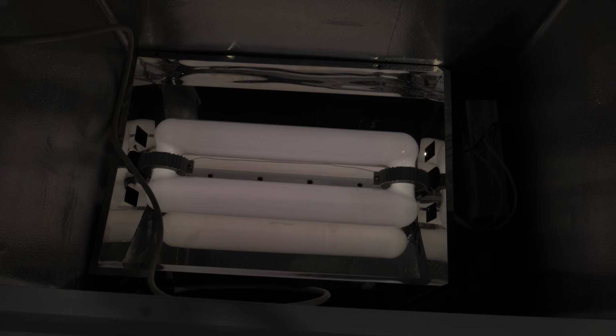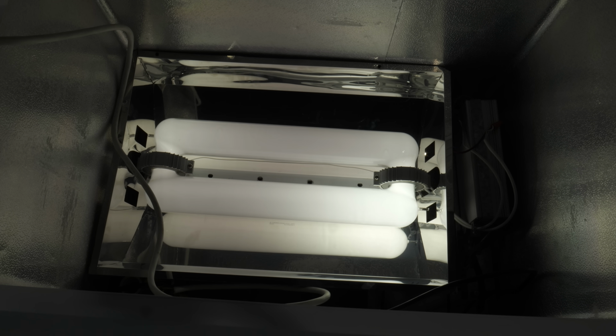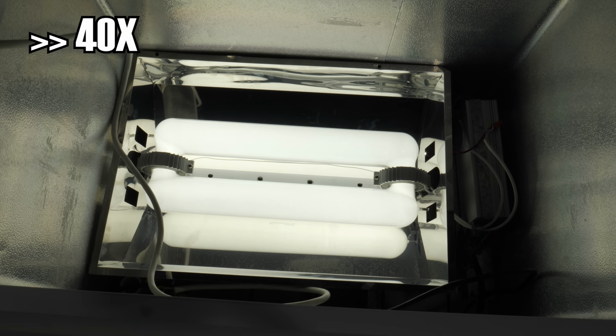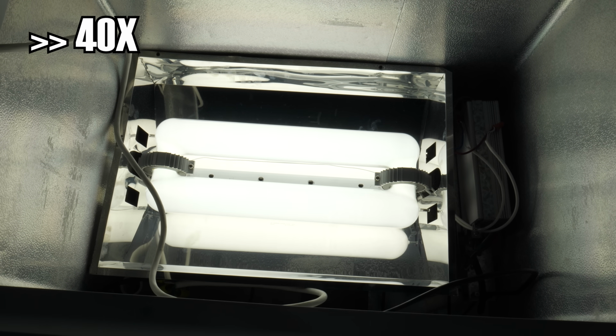In fact, street lighting is one of the most likely places you're going to find these in the wild. And I live where the outside air sometimes gets colder than a freezer. So I put this whole thing inside a freezer overnight to see how quickly it would warm up from truly cold. The lamp had no issues starting, but like most fluorescent lights in this temperature, the mercury was barely contributing anything, and we could see the purple glow of the argon starter gas. Interestingly, it initially did the same thing where the light output seems to grow from the mercury pellet, but before long that bright spot disappeared and it all averaged out to a very dull gray. It took about 10 minutes to attain full brightness, so it looks like cold weather performance has only improved slightly. But at least it had no trouble starting.